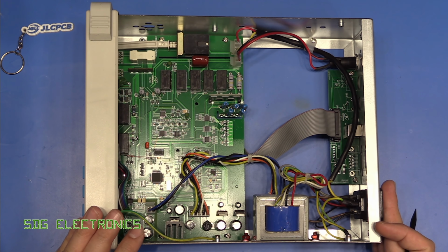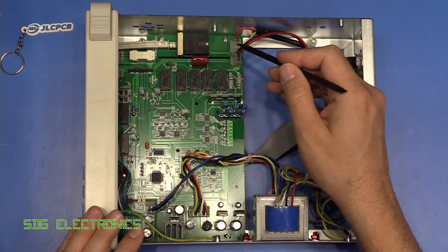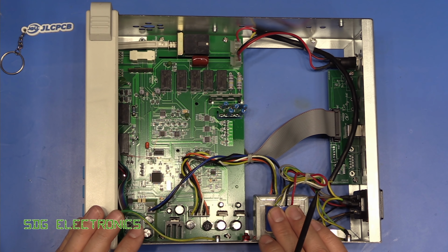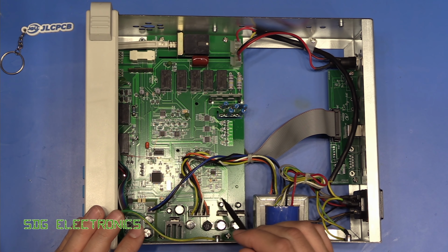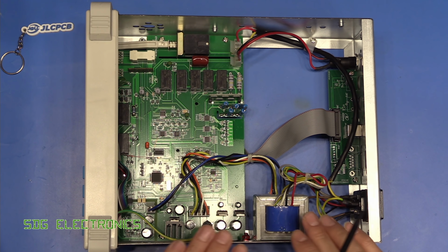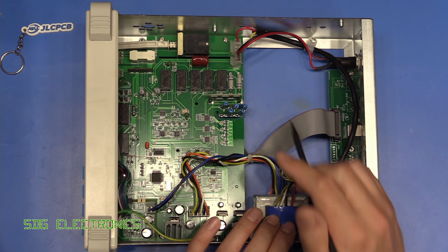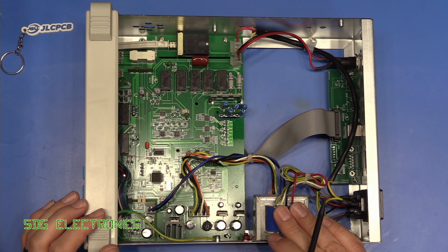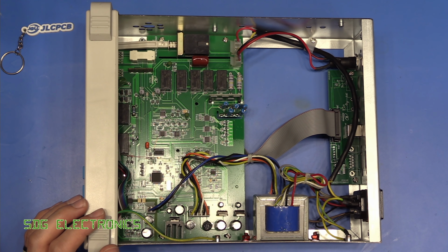We've got the AC connector, we've got a power switch, we've got some connectors actually connecting to the power switch. It's unlikely to be the transformer on its own, but it could also be something on the connectors to the PCB. So if we're seeing the problem with every supply rail, that suggests it's something either the transformer, the switch, or the AC input. If some of the supplies look clean and we're seeing some noise on others, then we need to narrow our search down further.